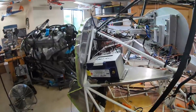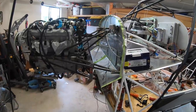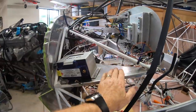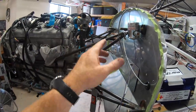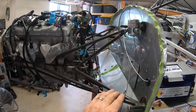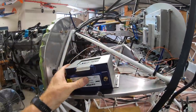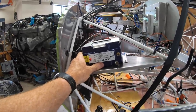I'm working on getting this battery mounted. It's been back and forth on where to put the battery — I originally wanted to put it right here, but I've decided to put it on the cockpit side of the firewall, mostly to free up space on this side for the coolant reservoir and the oil reservoir. I also have the radiator and some other things, so I want to keep it fairly limited on what I put on the front side. I did talk to EarthX — it's totally fine to mount the battery in a horizontal instead of vertical position.